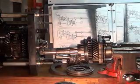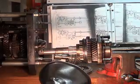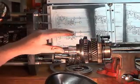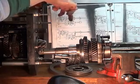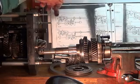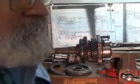I hope you got that. We're going to keep this video shorter and hopefully that's going to make the light shine brighter, so you know how that power is transmitted and how the clutch hubs move back and forth. You've got that same clutch hub — here it is between first and second — and the top one goes between third and fourth, it works the same. All right, there you go. I hope you enjoyed that, and we'll keep going. Thanks for watching, thanks for subbing — Easy Jeezy out.